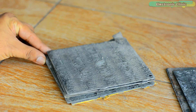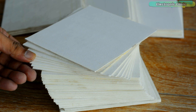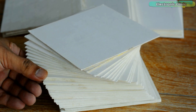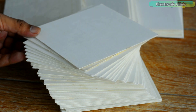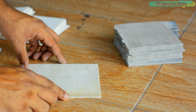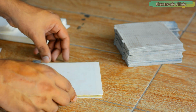You will need 30 ground plates. You will also need separator sheets — in the market you can find cheap and expensive ones, and again I recommend going for the expensive ones if you want long battery life. Separator sheets are used to insulate the positive plates from the ground plates. All you need to do is sandwich all the plates, making sure the rough face of the separator sheet is towards the positive plate.